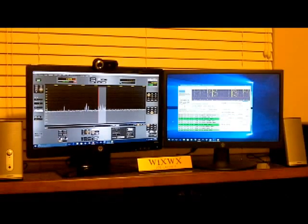What you see on the left is the operation screen for the Flex 3000 — Power SDR is the software — and you can see some of the signals coming in. I'm tuned right now to 7.076, which on 40 meters is where the JT-65 folks hang out. That .076 applies to all the other bands, so on 20 meters you'd go to 14.076. Remember, regardless of where you are, it's always upper sideband. Just go to the .076 of whatever band and you'll be on the JT-65 signals. They sound kind of like music — I'll let you hear those in a little while.